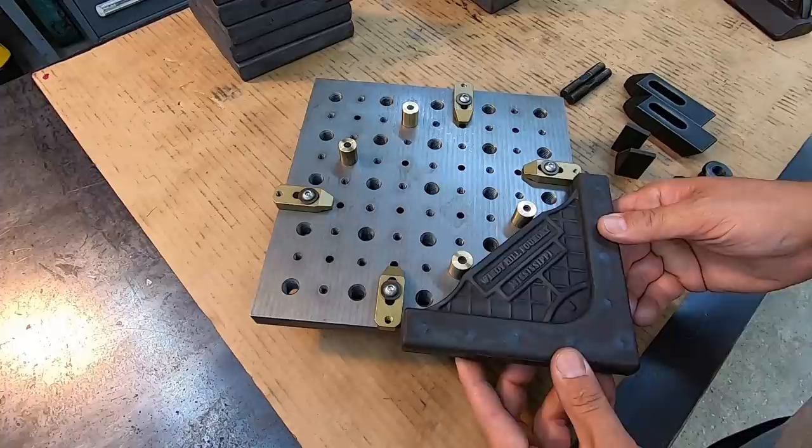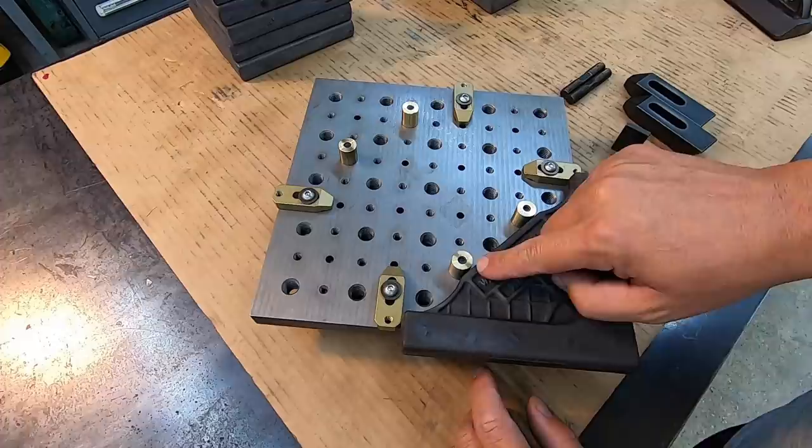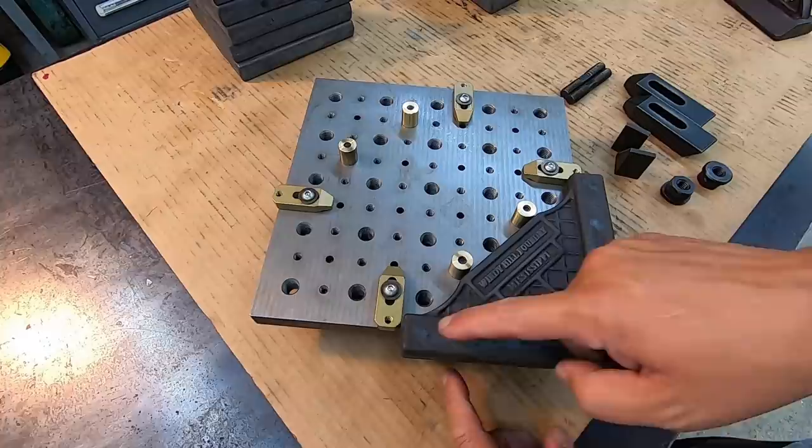We will get it set up in there like I got right there. And then we'll double check and make sure that our angle is good. But I feel like once we get started on setting them all up at this 45 degree, since these are precision right here, we should be able to push those up against that fence right there. And then once we machine it, they'll all be at 90 degrees right there.